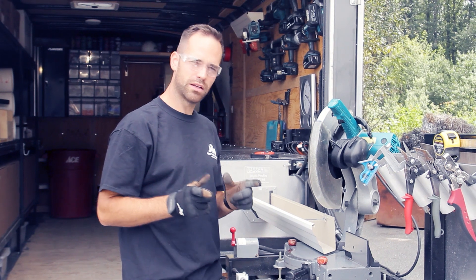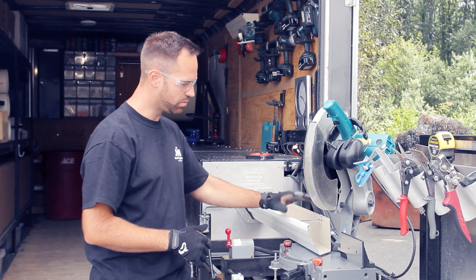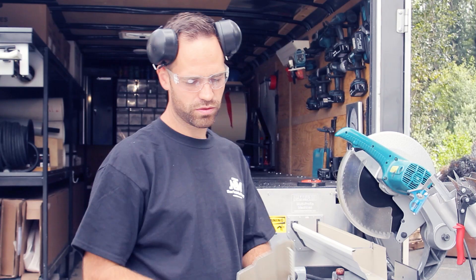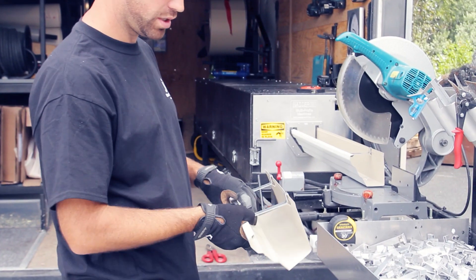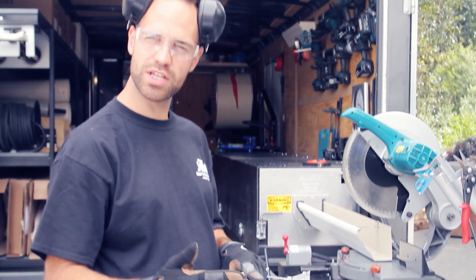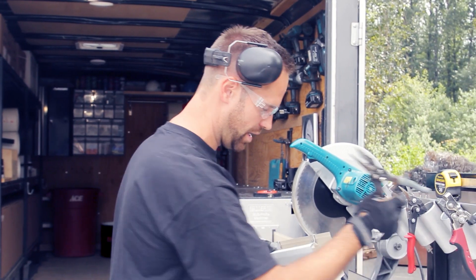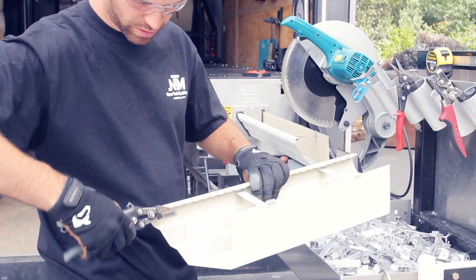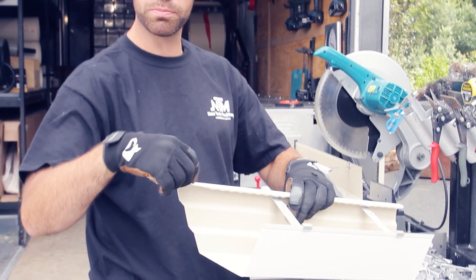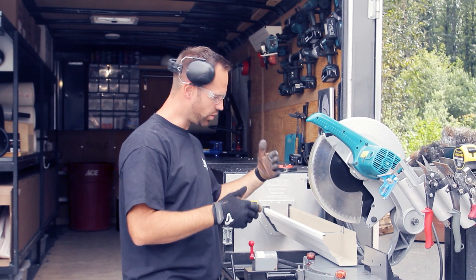When you're making your cut, make sure that when you cut at 45 on this side, you put a bracket inside the gutter and press it against the backing of the saw. For an outside corner, we usually cut it straight off on one side here in BC, and then the other side that comes in — that's the one that gets the flaps. So we cut it straight and then with our flat benders we just flatten the lip a little bit, so when the other gutter piece comes in it fits in nicely and then you can put your screw in the top.